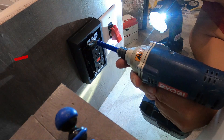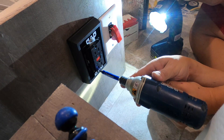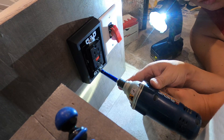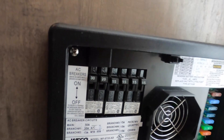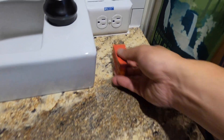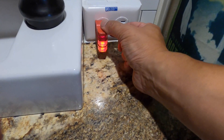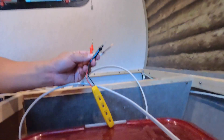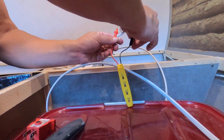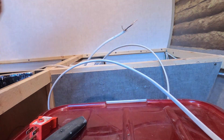This black spacer mount was actually pretty helpful in giving me more space to work with — having four wires coming into this junction box takes up a lot of room. To see if everything is wired correctly, I turned on the main breaker and then went around and tested all the outlets. Two orange lights means correct. Pressing the black button on the tester trips the GFCI, so I made sure that was working correctly also. I used my wire tester on the wire that will connect to the new outlet and made sure I saw 110 volts light up.